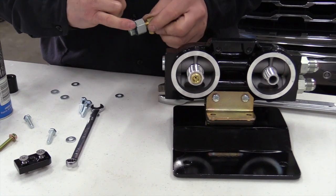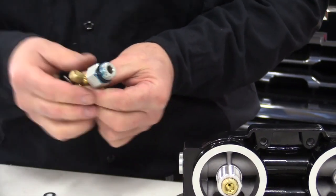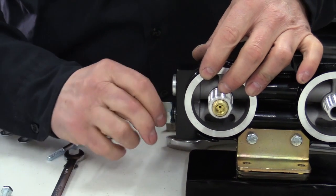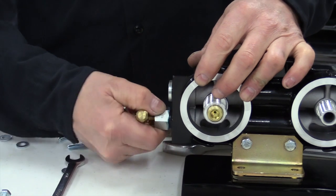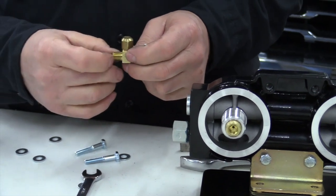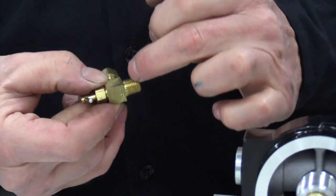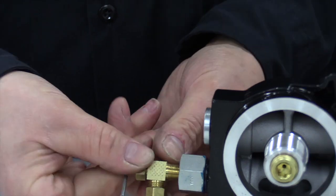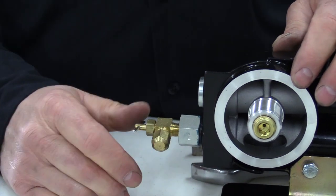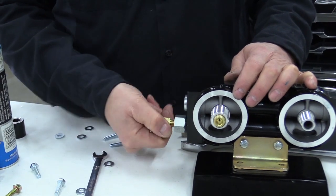With this little sample valve, we're going to put a little grease on that as well, and then that gets screwed in. That'll tighten up when I get under there once I get everything mounted and solid — it'll be a lot easier. I just want it pointing straight down. These threads here are tapered pipe threads — put some pipe thread sealing on there, pipe dope. Make sure you don't get any inside because it'll mess with your sample; just keep it on the outside of the threads. Then tighten that up last to the position you need. First tighten up the silver one down tight all the way against the metal, and then tighten this one down. Don't over torque it — I've had guys twist these off trying to get them too tight.